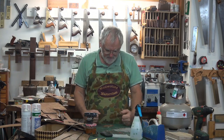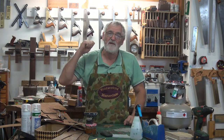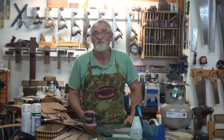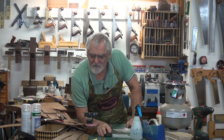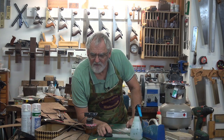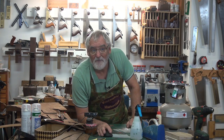The eye is wonderful. It looks over a lot of mistakes that squares pick up. But basically, that's it. Cut square, work square, check for square, and then when it's finished, make it square if it's not square. No other advice than that. But start with flat square boards. That really helps. During initial assembly, when everything's still there, just hold it square and clamp it square.